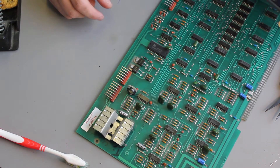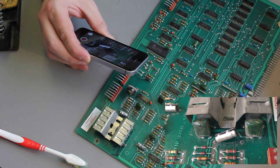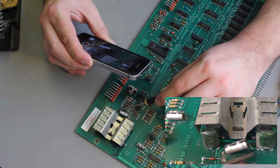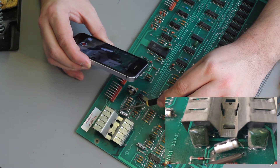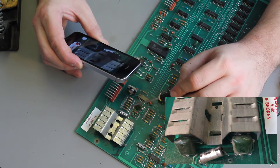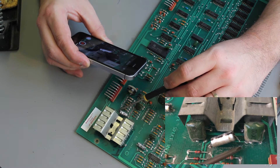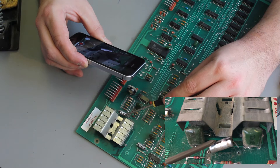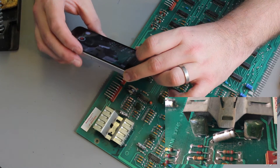I just came across something I want to show you. While lifting this axial capacitor here, I've pulled the other side of the via off. That's not a problem in this case because this is an isolated via — there's no trace coming off this side of the board, so there's no electrical connectivity issue. The traces on the other side of the board are fine, so I got lucky. It was just a little disk of metal that came away. Judging by the corrosion on the other side, I think this capacitor may have leaked a little bit — just something to be aware of with older boards.